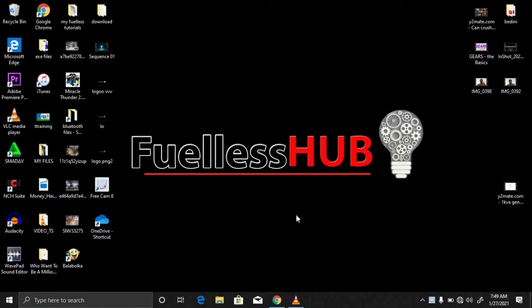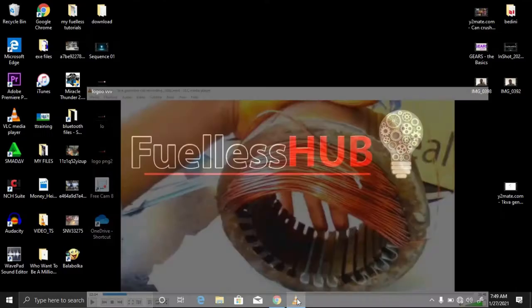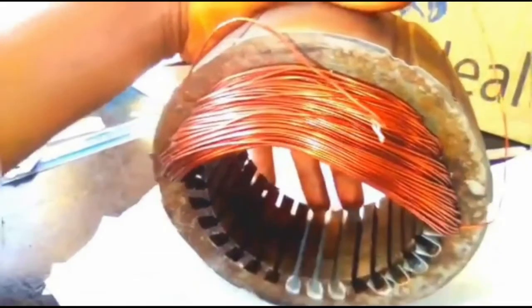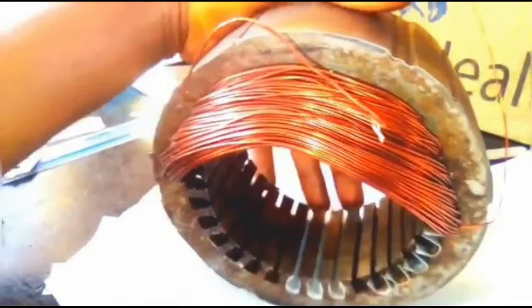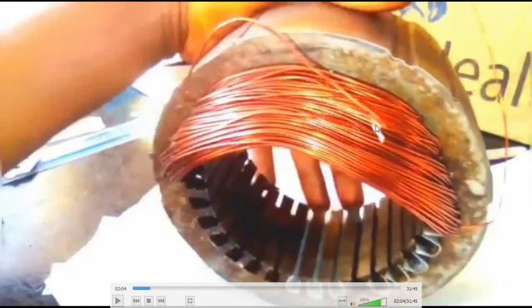Let's take a good look at the stator right here. As you can see, here is the stator — here is one winding because the winding starts from here and ends here. All these poles you see here — one here, one here, one here — they are 30 in number, they are 30 slots. The whole of this side will contain 15 slots, that is five here, five from here to here, and five here, and they leave another space in between.